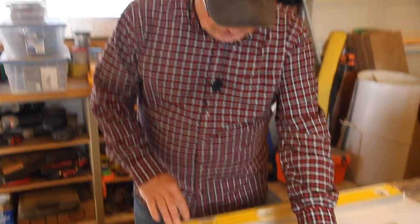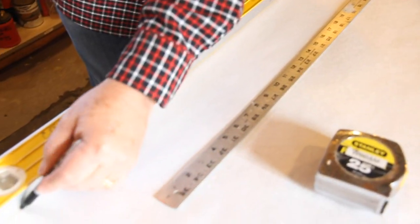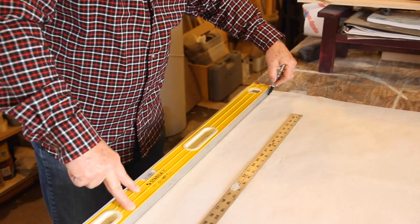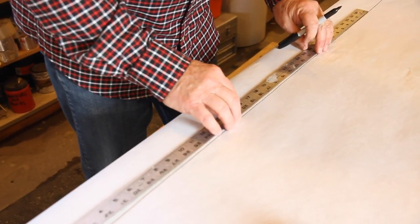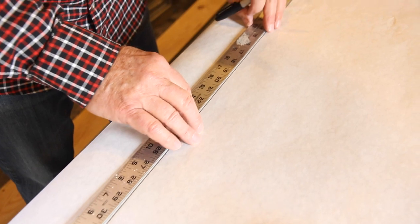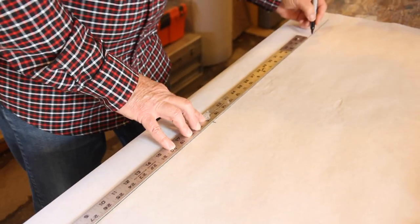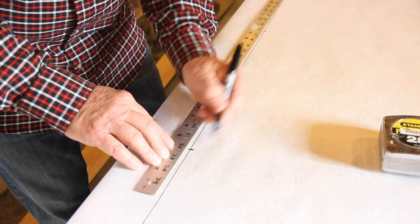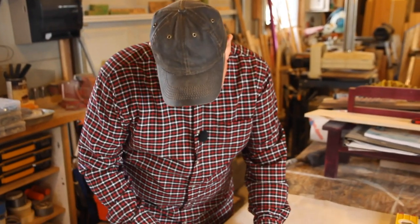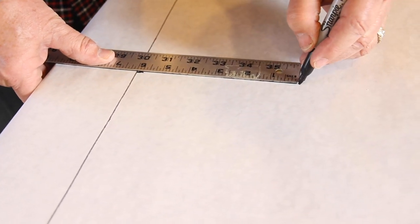We'll make it 32 inches wide but six inches tall in the center. Using a piece of butcher paper or plain paper, I'm using a straight edge — here's my framing square — and I'm just gonna draw a baseline. We're gonna take a segment of that out using one of my little yardsticks and set 32 inches. We know that 16 is the center point, so we go 16 that way and 16 this way to 32 — those are our two points of the arc. We want six inches tall, so we're just gonna throw in a six inch mark.